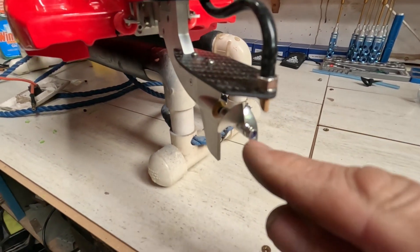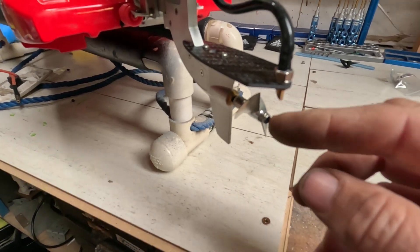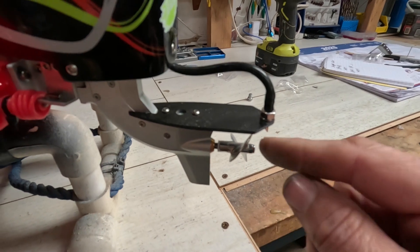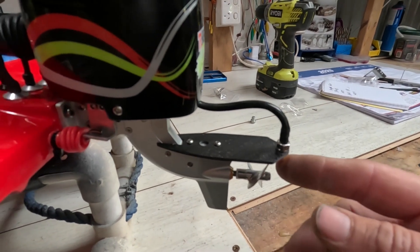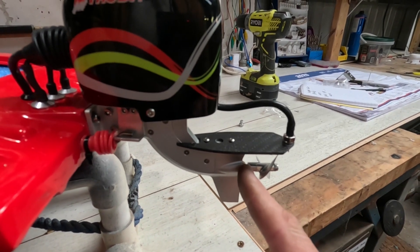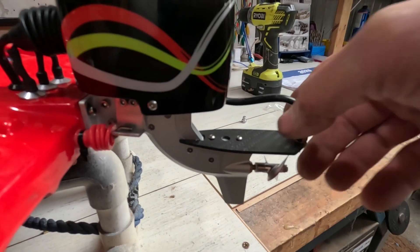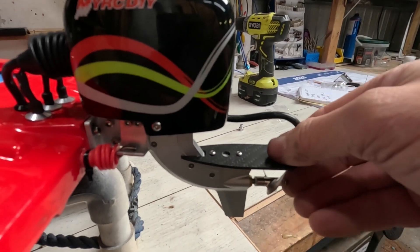One thing I don't like is the prop — they give you a tiny 32mm prop and there's not enough thread after you put the prop on to reach the nylock nut. Since we're heading out right now I put super glue on there just to hold it — that won't go anywhere. You definitely need the Teflon washer on this one though, because as soon as the prop pushes it lifts up. It would have been better to move everything forward but you just can't.